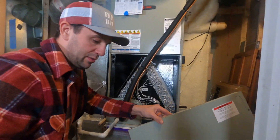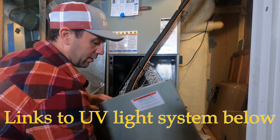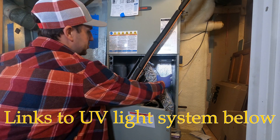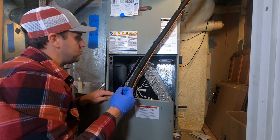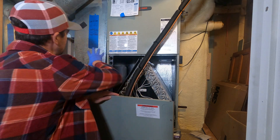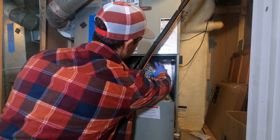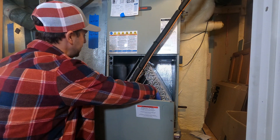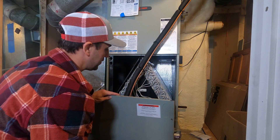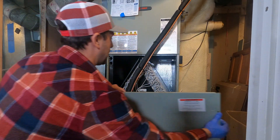We're going to put this back together. Like I was saying, I installed mine in the air handler unit so that it had a lot of metal to reflect off of. What that does is magnify the amount of UV you get — instead of putting it in a duct with just four corners to magnify. This has so much metal, and all the air goes through here, so it basically kills all those viruses and germs as it's going through. That's why I installed it here.